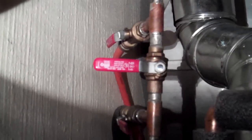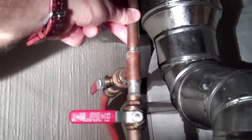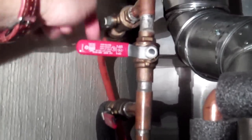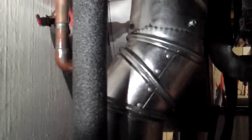This is the cold water destined for our hot water heater. It's diverted first to our thermal storage tank, so it runs through that coil of pex, gets very hot, comes back, and then feeds our regular water heater. Our regular water heater runs very little, or not at all in most cases, unless we have cloudy days. That's how the hot water portion of this works.